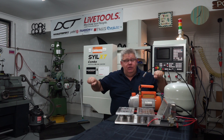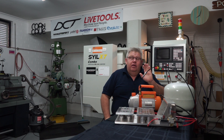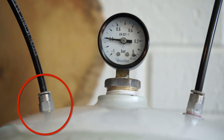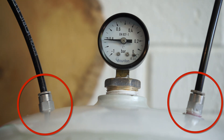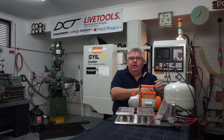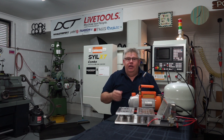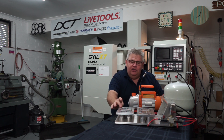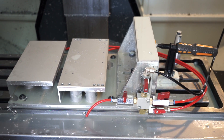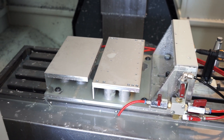I had to put the valve upside down in the vice with two big tyre levers on the bottle to crack it loose. Once that was done I bought a blanking plug, drilled and tapped a 1/8 BSP hole, and put in a vacuum gauge. The bottle wall is only about 2.5mm thick so I used fibre washers to get a seal, and it worked. The tank acts as a vacuum reservoir so I've got plenty of vacuum on tap, and any coolant that slips under the O-ring ends up in the tank rather than the pump — which proved useful when I machined 56 pairs and got about half a cup of coolant in the tank but none in the pump.